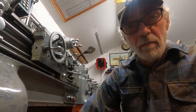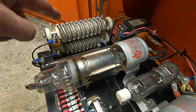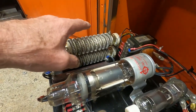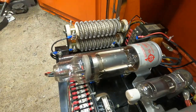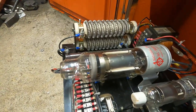You can look in some of my earlier videos on how the machine responds — how it comes up to speed and how the dynamic brake works. That's one of the critical things: when you put it in neutral or stop, it throws these two heavy coils across the armature of the drive motor and brings it to a rapid stop. The energy is dissipated in here and converted to heat. The later solid-state version did away with this and used regenerative braking, pushing the energy back through the mains.